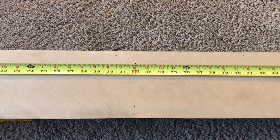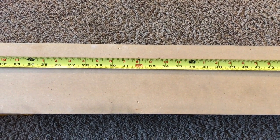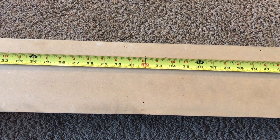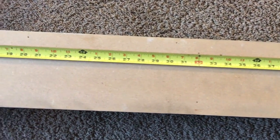The first step is to mark the back where you want to put keyhole slots. I chose to do three on this six-foot-long shelving. There are a lot of different ways to fasten it but I like to go right into the studs of the wall — it gives you a lot of strength and it'll hold up good.